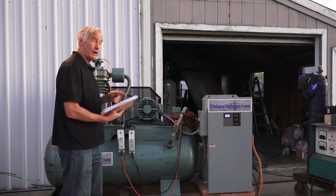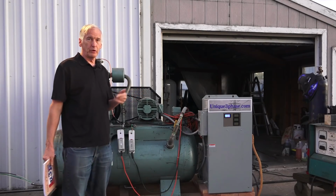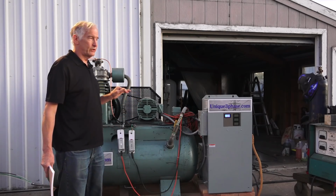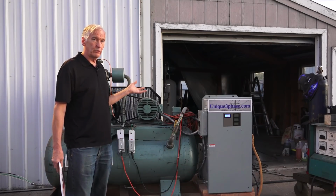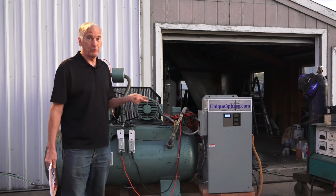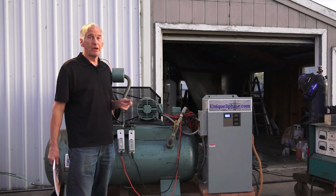And it even tells you another thing too, about people that have rotary converters. I built a bunch of rotary converters. I did a whole bunch of testing and it's in the book here. And actually, the rotary converter is not as bad as you think in using electricity. When I tested it, I got a real live genuine electric meter, and I hooked it up and did all sorts of loads. I found out a 10-horse rotary, a 20-horse rotary, and a 30-horse rotary all basically use the same wattage, the same amount of money you're going to pay to the electric company for running those things.